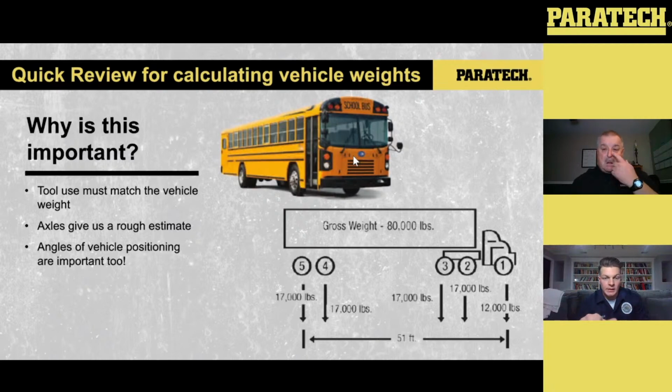So in this case, if we're dealing with 40,000 pounds, because we automatically cut that 80 in half, because I'm pivoting off of the front end, whether it's off the kingpin or wherever we're pivoting from, if that thing's resting at 15 degrees off the ground, now I know I'm dealing with 30,000 pounds of that 40,000. If we go up to 30 degrees, I'm dealing with half of that half. So I'm dealing with 20,000 pounds of that 40,000.